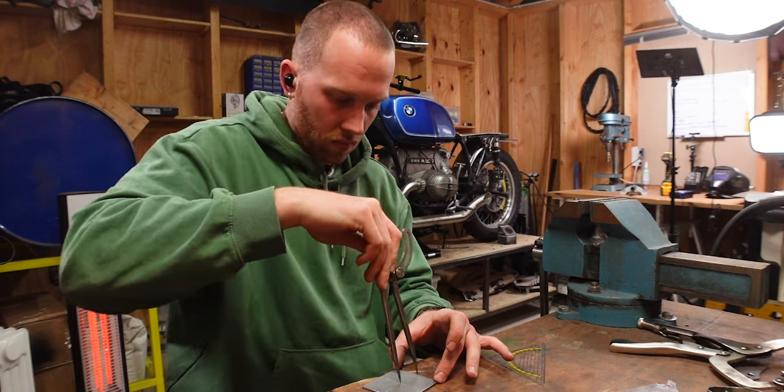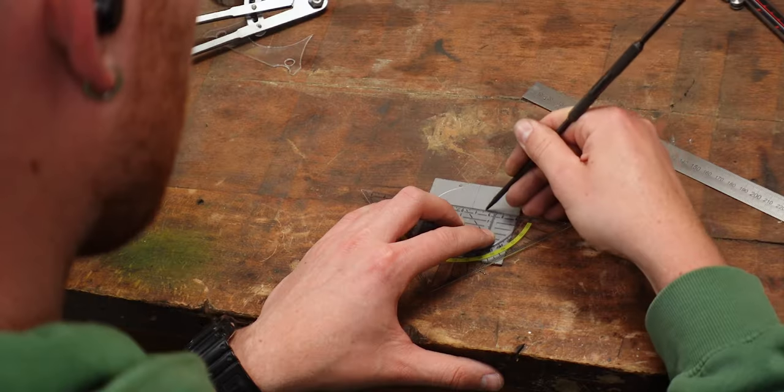The plate part of the bracket is done, so we can now move on to the bucket. With the prototype bucket, I actually drilled the holes after I welded it onto the tube. I noticed that I should probably do that before, to get accurate measurements and proper hole placement. So we're going to do that first.